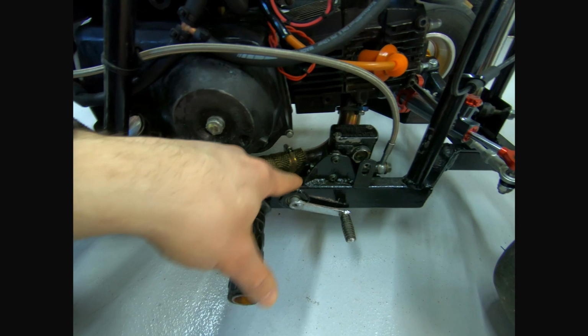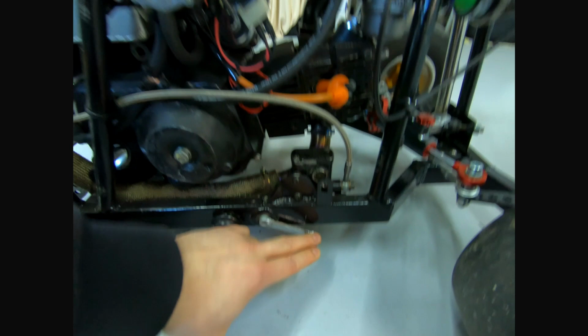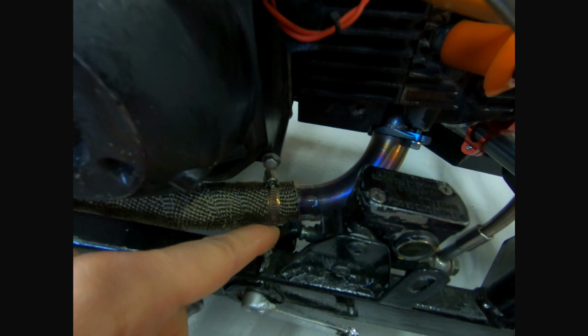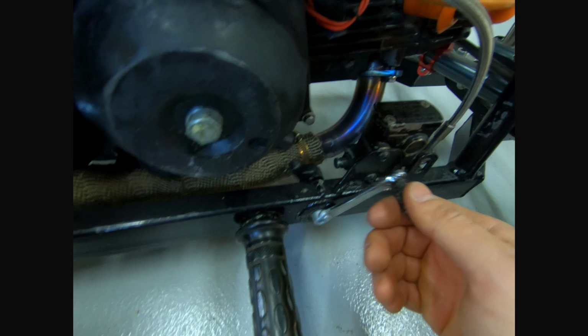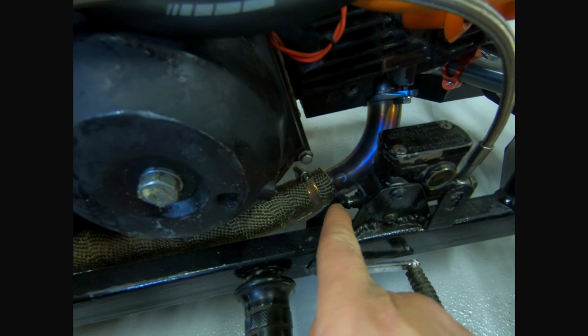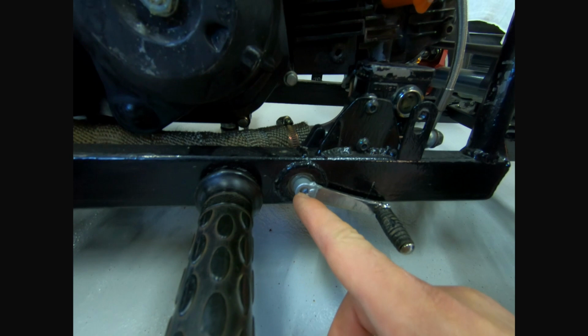You have two bearings inside here. This works really well and hasn't broken, not even one time, which is funny. This little thing that actuates the brake cylinder is actually chopped off out of the hand operated brake pedal, and it's held... You cannot weld aluminum to steel, unfortunately. So I made here in the back, maybe you can see, a steel plate that has pins that go in this aluminum thing, and that's how I connected this aluminum to the steel shaft, which is actually just an Allen bolt running through the bearings. And it works really, really well. I didn't have any trouble with this.